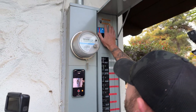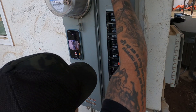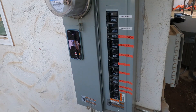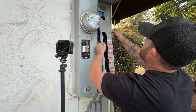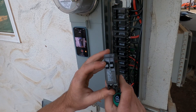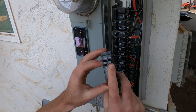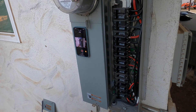First thing we're going to do is go ahead and kill power to the house. We're going to take this panel face off, rearrange some breakers - this should be a quick easy job. When I went and bought this breaker setup I got a split 20 breaker because I thought I was going to need to condense some of these breakers in this panel.